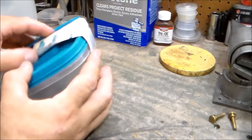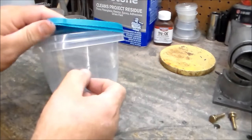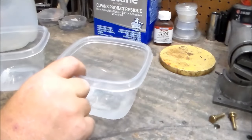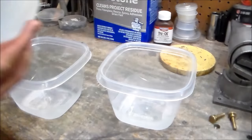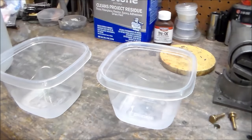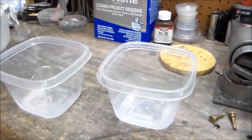This little two-pack of containers is perfect. I want one container to mix the acid in and another to be a rinse tank to deactivate the acid. I don't have running water in my shop so I picked up a jug of cheap water. If you're doing a part that really matters, you might even want to put a tablespoon of baking soda in there with your water to make sure you completely kill the acid.